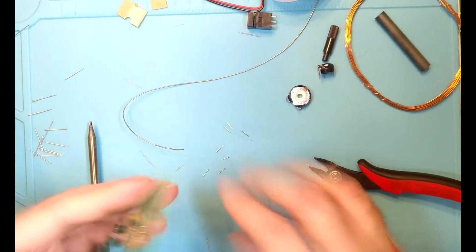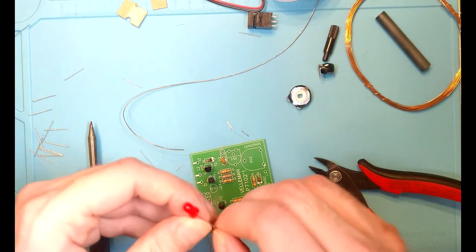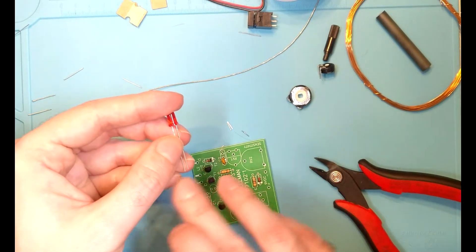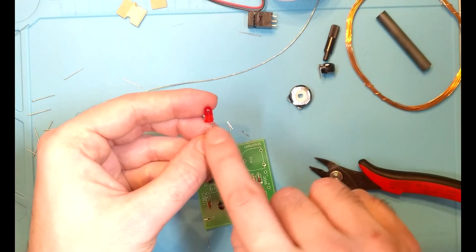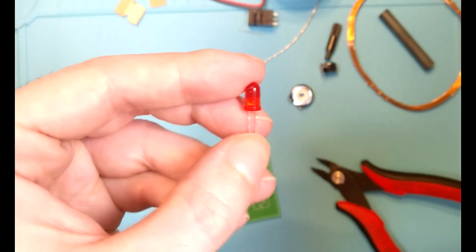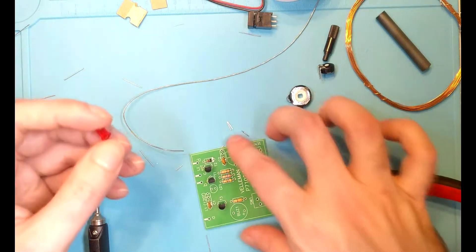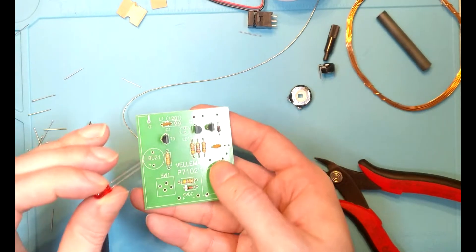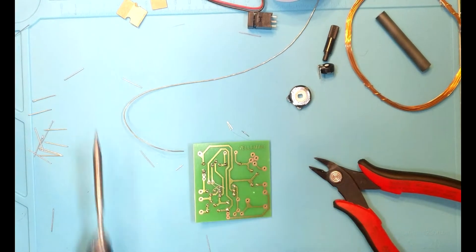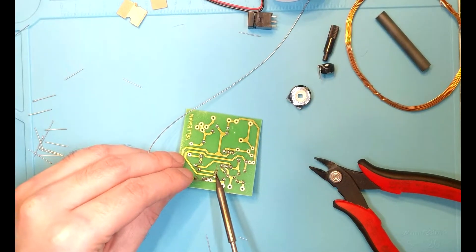Alright, there's that going on. The next thing is just going to be an LED. As we've talked about before, the negative lead is the one with the flat side or the shorter lead — although sometimes with LEDs the lead lengths are reversed. One way to make absolutely sure you've got the polarity correct: there's an anvil-shaped part inside the LED, and that is the negative side. In this case they just have the shape of the LED on the board, so we'll match the flat side of the LED up to the flat side of the silk screen. We'll socket that right in there and flow those solder joints on.